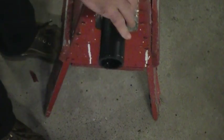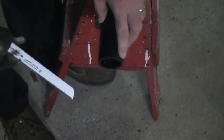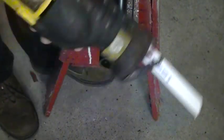If you're using a hacksaw, the blade has to be very tight or else your cut is going to sway off and it's not going to be straight. It takes a little bit of practice to make a straight cut with the handsaw. This is a reciprocating saw. I always use a blade that has 18 teeth per inch. It does make a difference — if you get a blade with 32 teeth per inch on the reciprocating saw, it will actually melt the ABS, because the strokes are so fast and the teeth are so fine. But 18 TPI works very well.